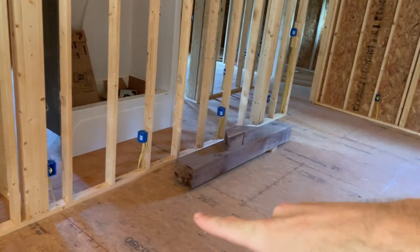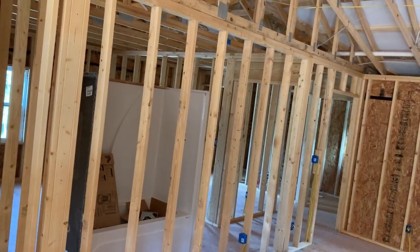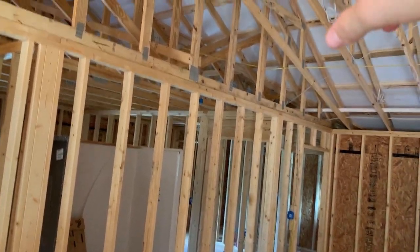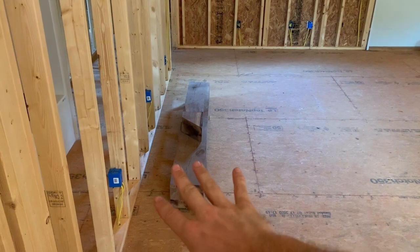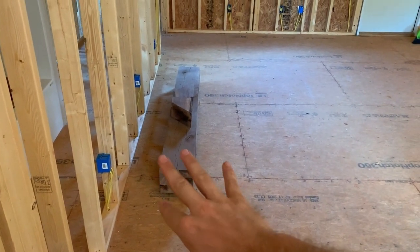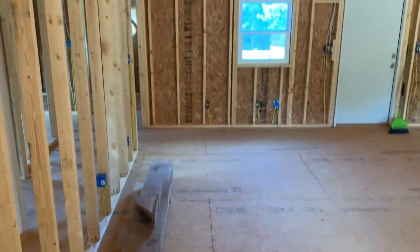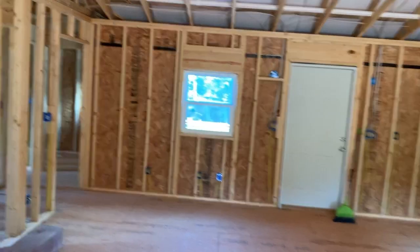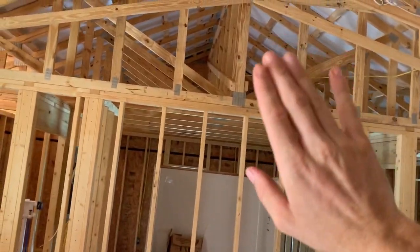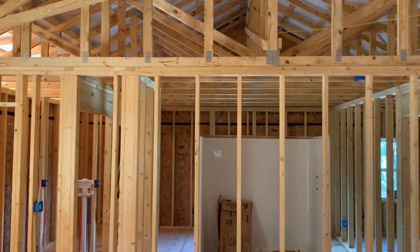The fireplace, when we frame out for it, I mentioned before, we got to put a plug for the TV. So these lights will be about 1 foot, the fireplace probably about 2 foot, or 2 foot to 26 inches, something like that. So these will be about 1 foot out from the fireplace. The only thing I'm worried about with that is when the TV's mounted there, if you're sitting down, you get a mount that you can angle the TV down a little bit. I don't want the glare off of those lights there.